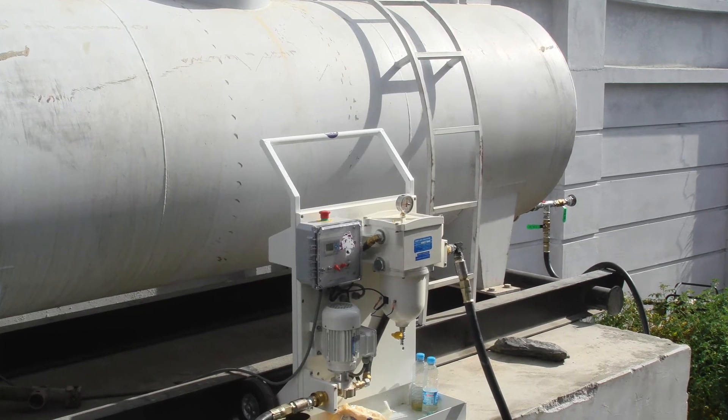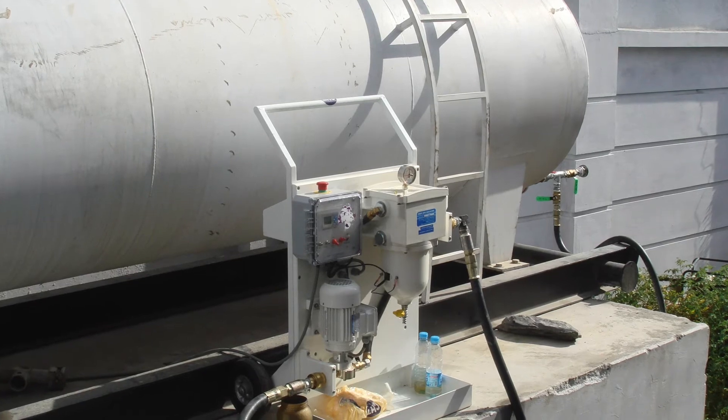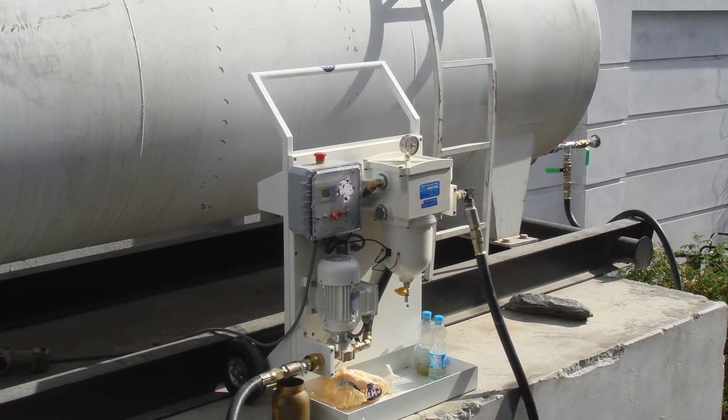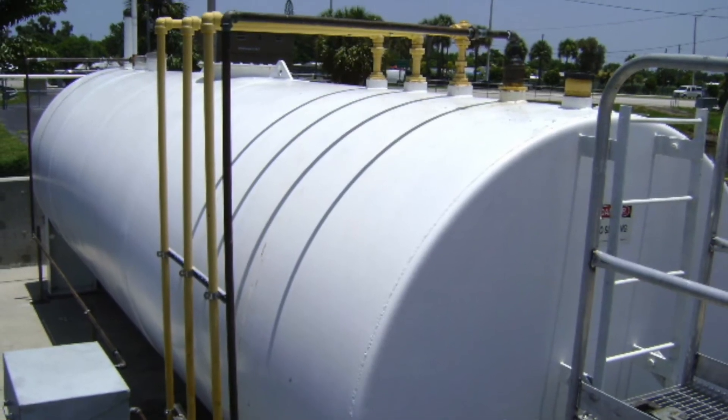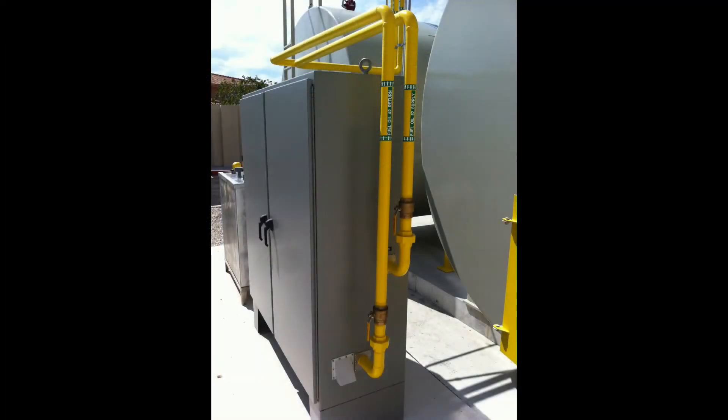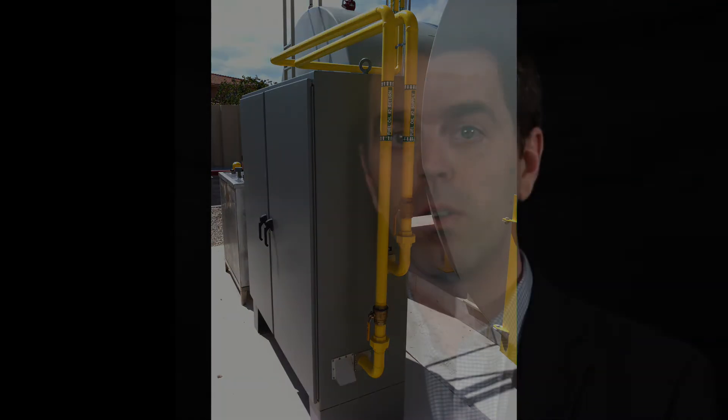Many people will sub this service out and have a company do this on a monthly, quarterly, or biannual basis. But do you recommend installing something permanent to process the fuel regularly? Yes and no. I recommend it if the application, installation, and the testing support the need for a permanent installation, then that is necessary. As water removal in a tank is a daily battle — we mentioned in another video how this water can accumulate quickly, even in a 24-hour period — having a system installed on the tank that can work just as quickly is the best way to maintain or improve the fuel cleanliness.